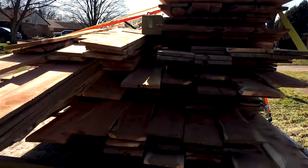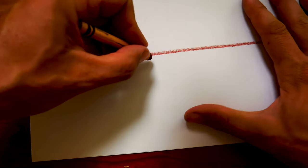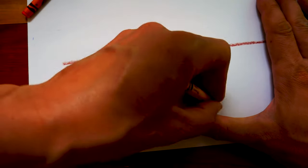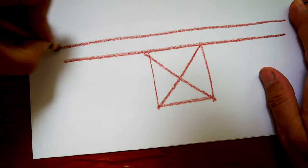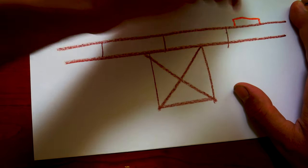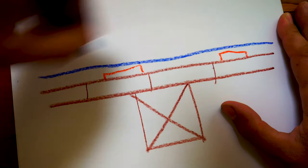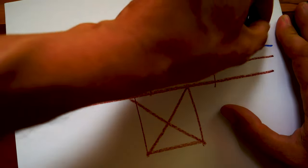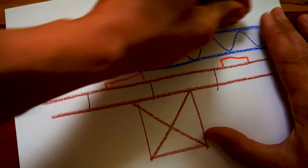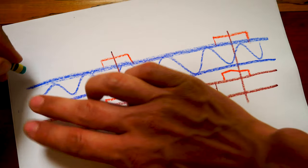So how do we get this stuff on the barn and still get it insulated? We start with what's there already. We've got the old structure — these giant 10 by 10 columns inside the timber frame. Then outside of that there's old pine decking, and that's the siding, and that's all there is. So we start with a batten layer, and we use that to affix an insulation layer. The barn's kind of wavy, so we can't just screw right to the siding. Then on top of the insulation layer we've got another layer of battens so we can affix the new layer of cedar siding to that, and these battens are fixed all the way back into the original structure.